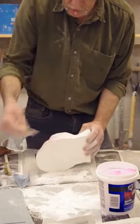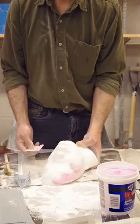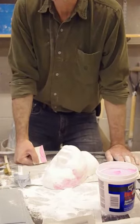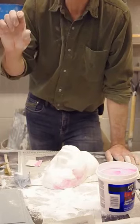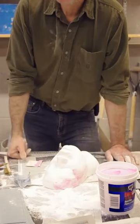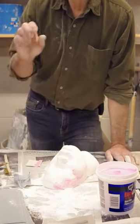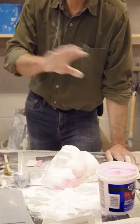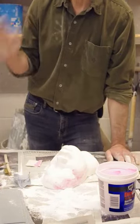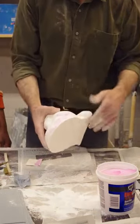What's the dry time on it, Terry? This is maybe about 20 minutes to dry. Would that be okay for building stuff up? Because one of my eyes is kind of bent. It depends how high you want to build it — how high do you want it to be? Maybe half an inch? This will work, but you don't want to put it on all at once. You want to put on a thin layer, let it dry, put another thin layer on, let it dry, and keep doing that until it's built up to the point where you're satisfied. One thin layer at a time.